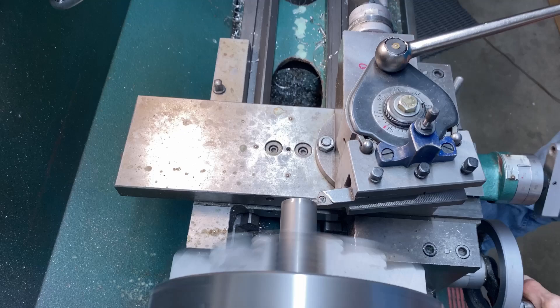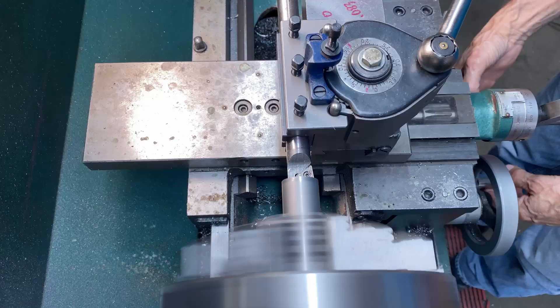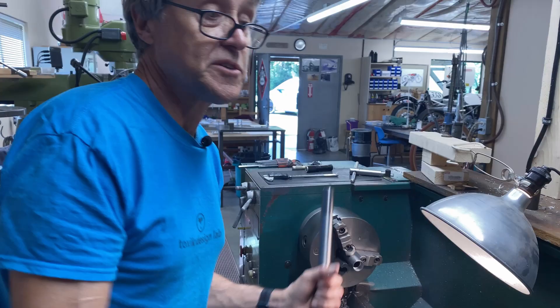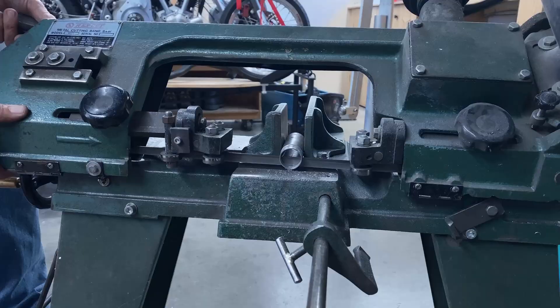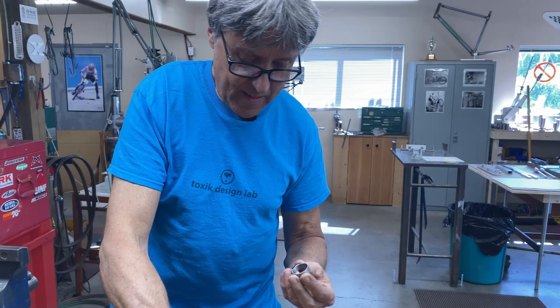I face the end and I'm going to bore the inside — I have a boring tool. I want it to just slide in so that allows the braze or the nickel silver to flow. Oh, look at that — I like that. It's got a little bit of play but it's not super sloppy. That's very good.